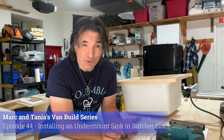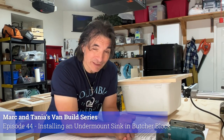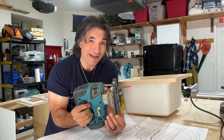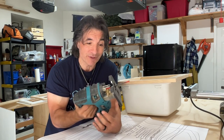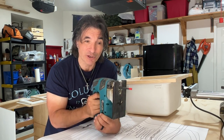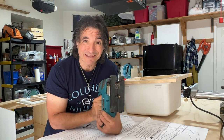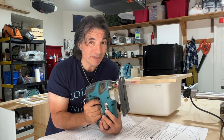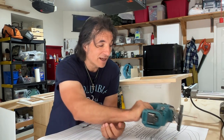I'm trying to think of the right tool to cut through this big piece of really hard butcher block, and I'm thinking a jigsaw is not it. I'm sure somebody out there is a Picasso with it and can cut really fine curves, but I think it'll come out okay at best — I'd have to do a ton of sanding and it still won't be great. But I think a router would be really good. This is a router bit — it's a half-inch shank, so this is a really powerful router bit, and I've got a corded router I could use it in.